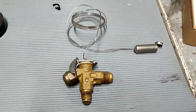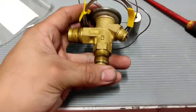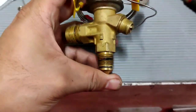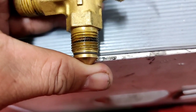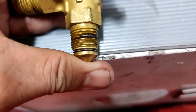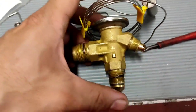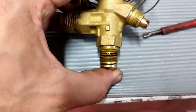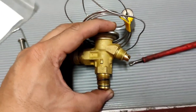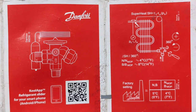This is the old one but it is working. There is counter pressure at the top side — that is the refrigerant — and when you push it, it will open easily. The small distance will open because the refrigerant at the sensing valve also commands the valve that needs to open.